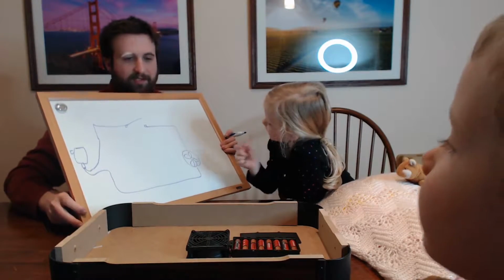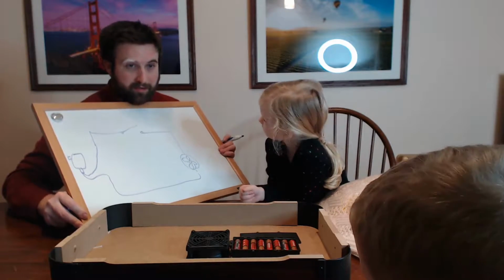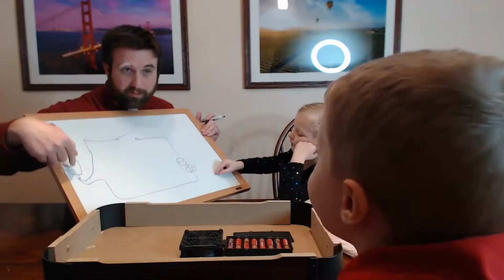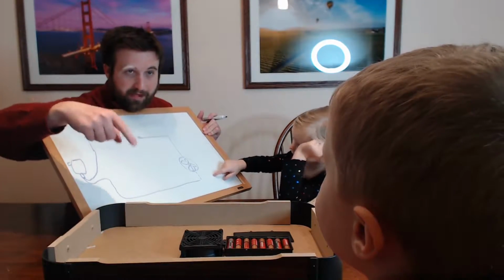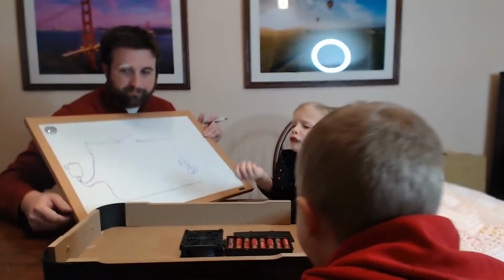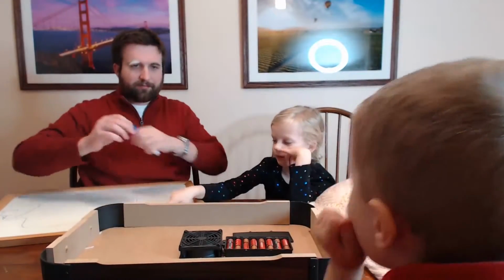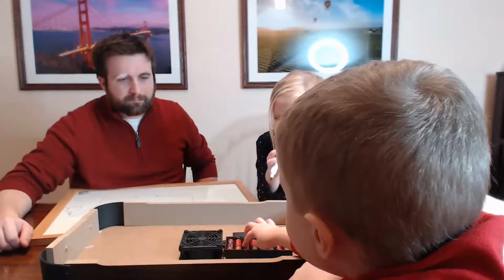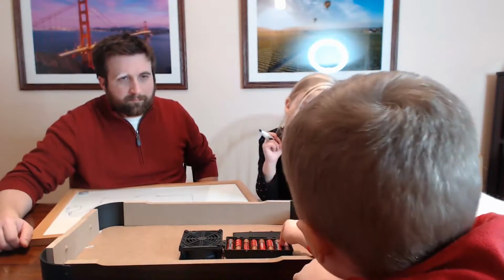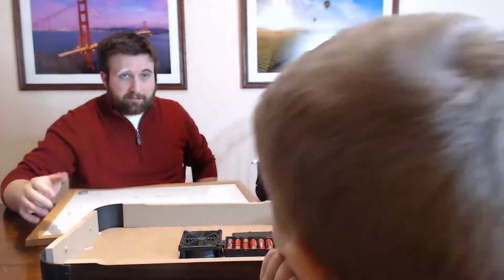Now the trick to this is we need to know exactly what the supply requirements are. So to convert from battery here to wall adapter, we just need to count up how many batteries there are, multiply that by 1.5. How many batteries are there? Well, let me count them. 2, 3, 4, 5, 6, 7, 8. Okay, so there's 8 batteries. What is 8 times 1.5?